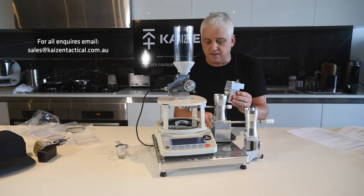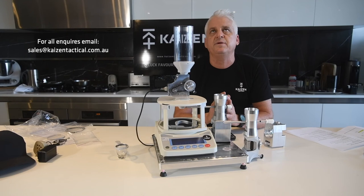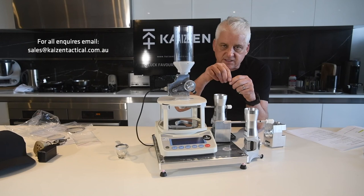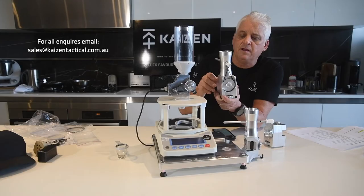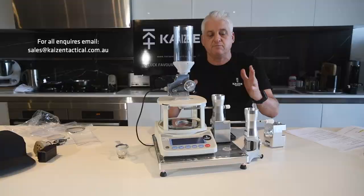If you have a vibrating trickler, the two most problematic issues are: belts that are either worn out or left in the window where the sun has eroded them — you can see all the little cracks in them. It's important that that belt be twisted — some people put it on and just go one loop without twisting it. If the belt gets worn or cracked it seems to shudder. Another thing is a damaged cable — we've had several where a cable has been cut or pinched and it gets an irregular feed and vibrates and jumps. We can change that with a new cable.